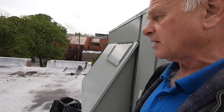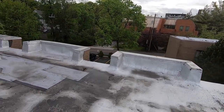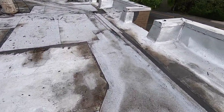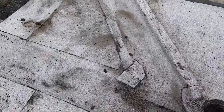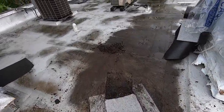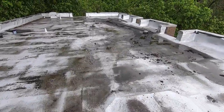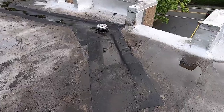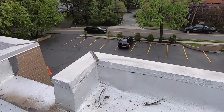I started making water releases for the ponding on this roof. There's almost no water sitting here - it rained last night and you can see I made a channel here, and another channel in this area. I made the drain lower so water can get through - there's a channel down there leading to the ponding areas. This was ponding huge before. There's another big ponding area where I've lowered the drain. The walls have no torch down - it's paper everywhere.